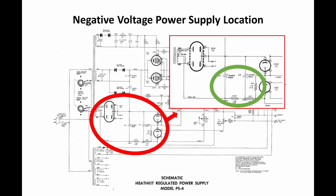The other 2 resistors, R19 and R21, weren't in too good a shape either. They are specified as 10% tolerance resistors. R19 was about 20% out of spec, and R21 was just about 10%. So I decided to change all of those. By the way, R19 is a 1-watt resistor, and R20 and R21 are 2-watt resistors. I upped R20 and R21 to 3-watt resistors, and R19, which was originally a 1-watt resistor, I replaced with a 2-watt resistor.